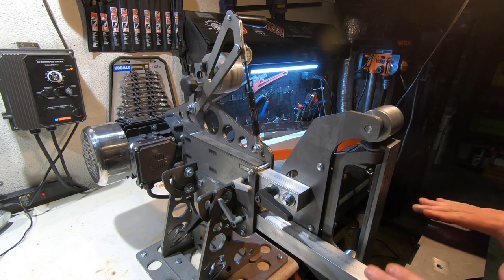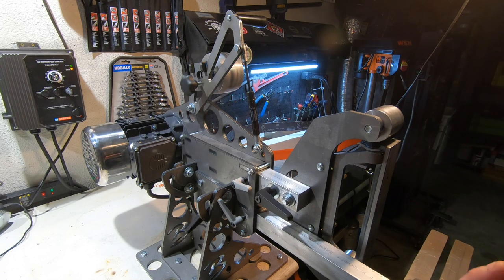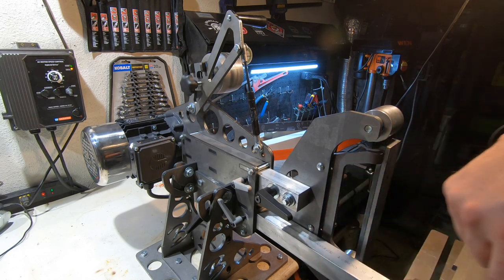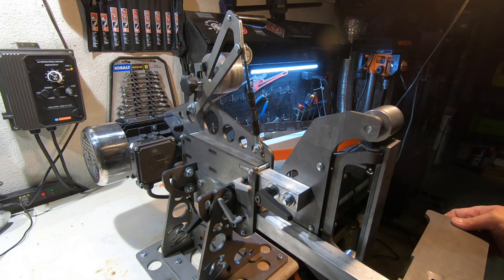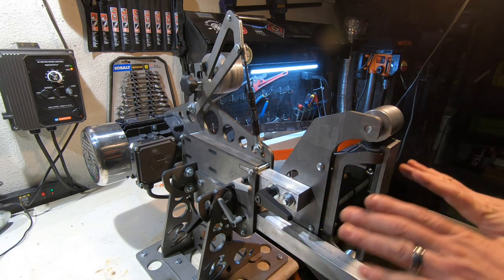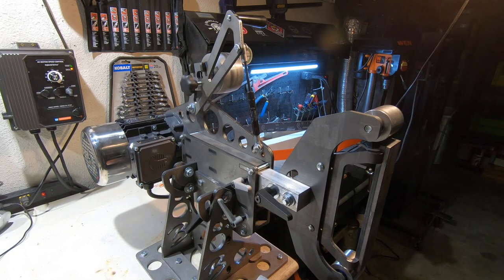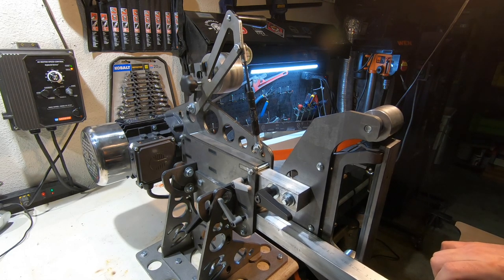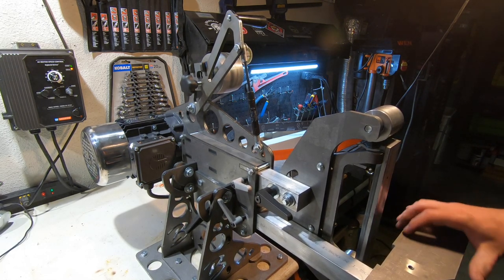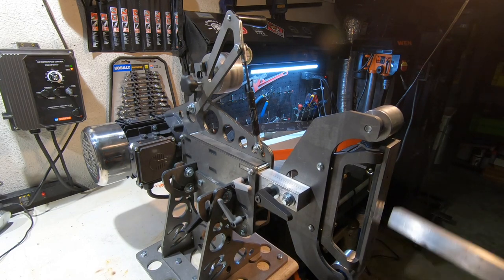I'll probably end up making another plate for a round wheel — just cut out perfectly round — so I can use my 10-inch wheel and the 4-inch wheel in horizontal mode for doing profiles. It's all one-and-a-half-inch tool arms, so super solid. One of the issues I have with some other grinders is there's play in them. On these, there's pretty much no play at all. They're really tight — a really nice feature.